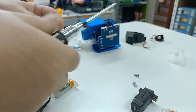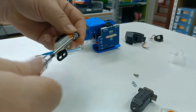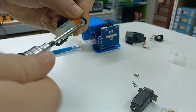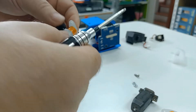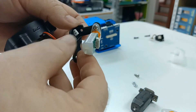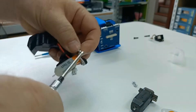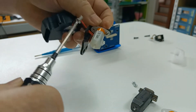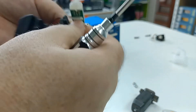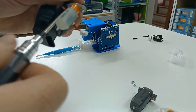Let's put a 3D touch together — they're all the same. Use the silver screws and the nuts. Screw it in on the right hand side first. Put the fan cable through the hole and pop that to one side. Now put your second screw in with the fan cable through the hole.